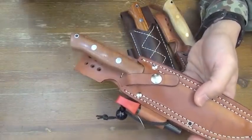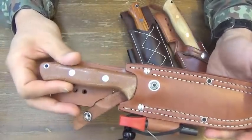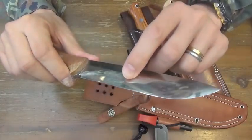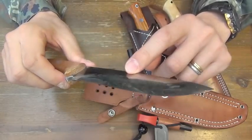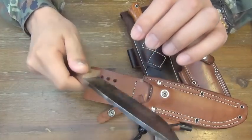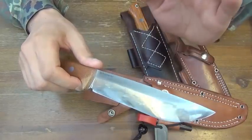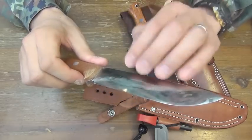Bravo 1.5, which came in at 35 degrees because of a microbevel. I eliminated it with water stones to make a bit smaller than 30 degrees. But it took edge problems — tiny problems — very easily after light wood work. Then I raised the angle to something like 30 degrees, and after that it did not take any edge problems at all.